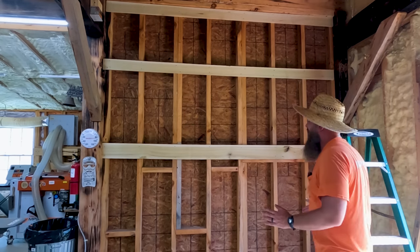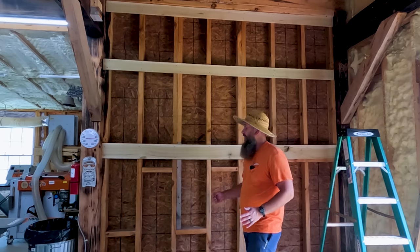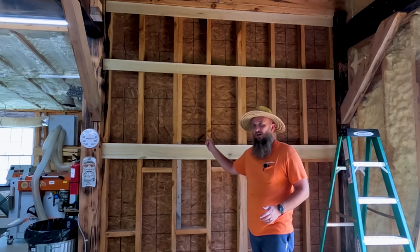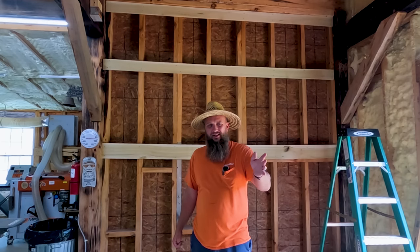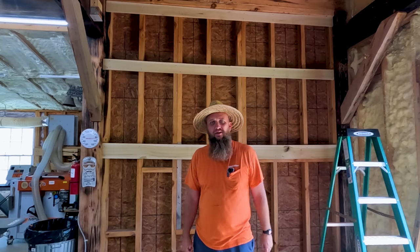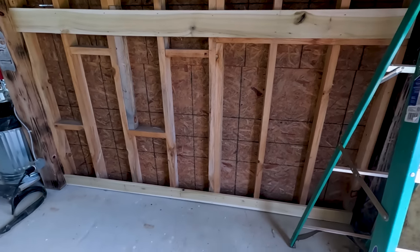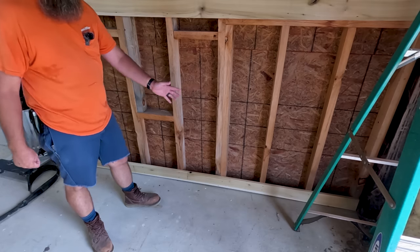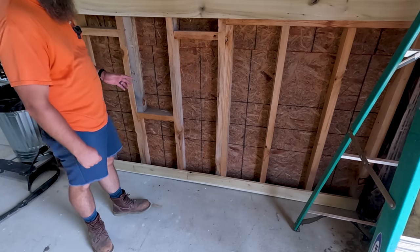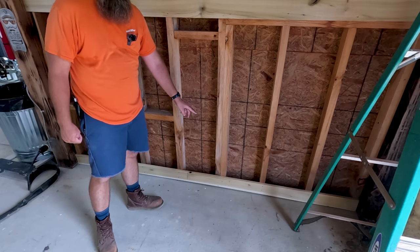Today's goal is picking up where I left off in the last video, setting up this area of the shop for the blacksmith forge. I think we should be able to get the metal on this wall today and maybe work on the wall behind you guys. I've got a small opening right here that was a doorway — it really serves no purpose, so I'm going to close that in because we've got a brand new drill press going on that wall over there. The first thing is to focus on this metal. If you watched the last video, you saw me install this poplar — these are our runners to attach the metal to. I call them girts. I've got four running horizontally on my wall.